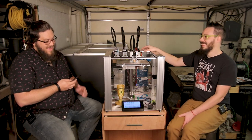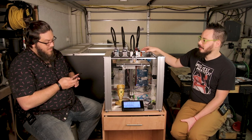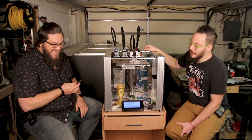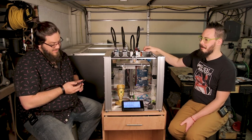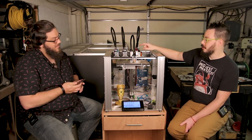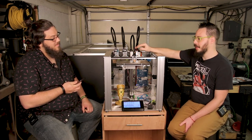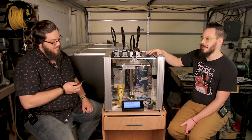Fair enough. Hot end height, what are the implications of using a mismatched tool on a line bed tool holder positions? We covered that one. The heights are set with G10s to do your tool height offsets. It's the same as any other printer. You jog the bed up until you get the paper underneath it, and then you tell it how far off of zero it is.